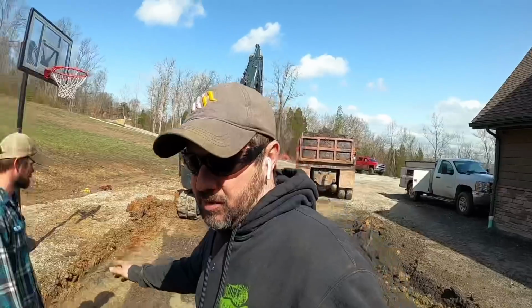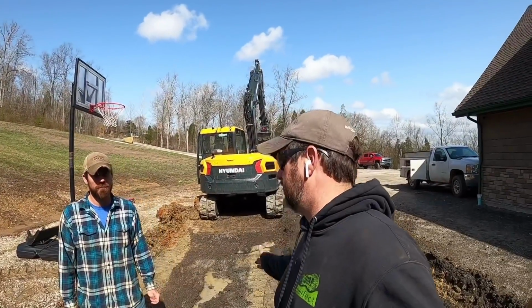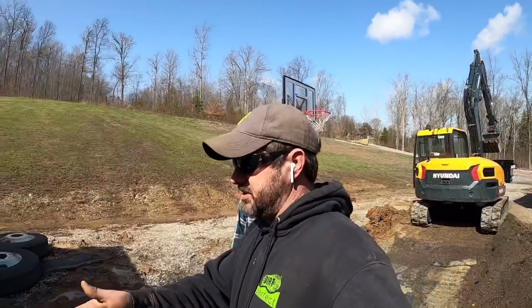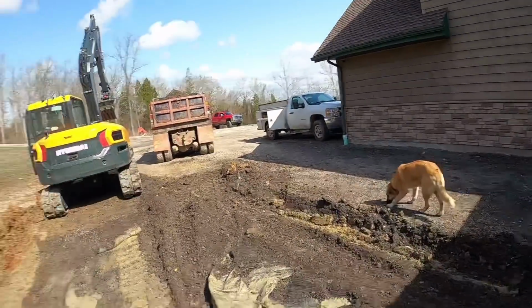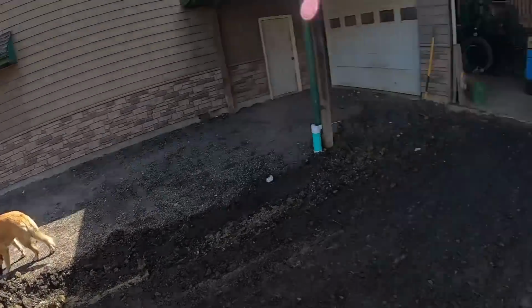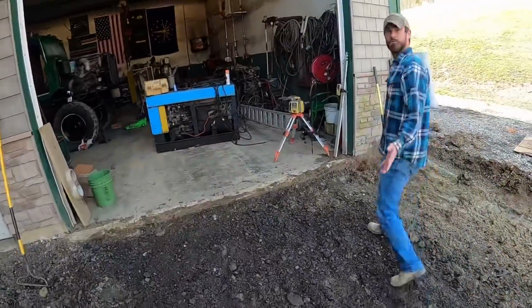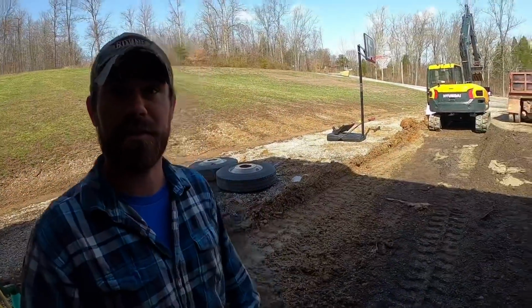All right, so Matt, this is 30 feet out. Okay. We're going 1 inch per 10. So every 10 feet I want to drop 1 inch. Understood. We're going for a 6-inch thick pad. I've got the grade level thingamabob. Maggie, did you take off my laser? Grade rod? Oh, it's right there. Yep. So, Mike, if you mark off your 10-foot increments, I can make an instant adjustment.